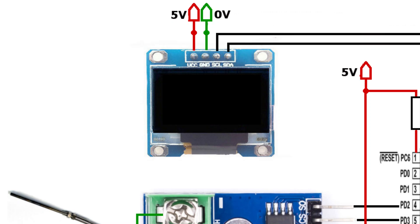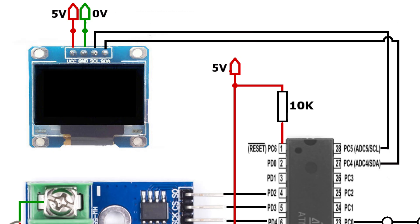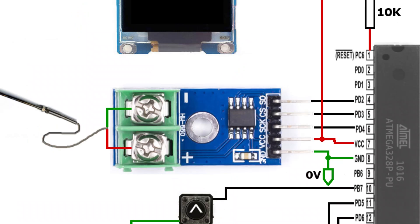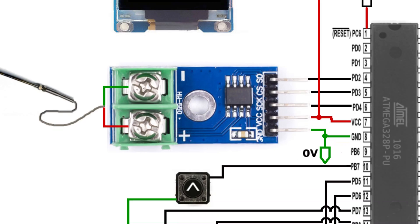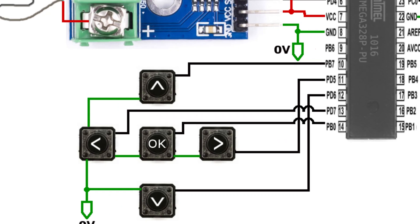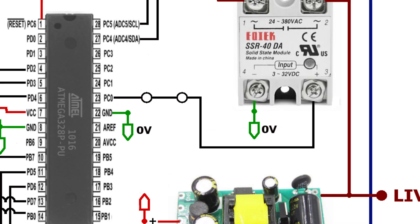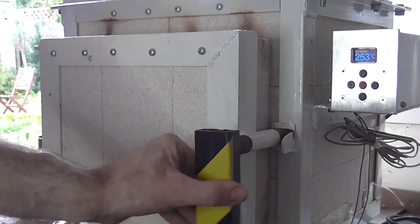The screen has an I2C interface and connects to the clock and data pins on the ATmega. These wires should be kept fairly short. The MAX6675 module connects to pins 4, 5, and 6 and also the power supply in that order. The 5 buttons for up, right, down, left, and OK connect to pins 10 through 14 in the same order, with each button grounding the relevant pin when pressed. Pin 3 on the SSR — the low voltage input pin — connects to pin 23 on the ATmega via the door switch, and pin 4 is connected to ground.